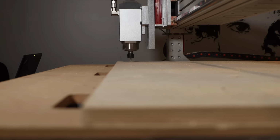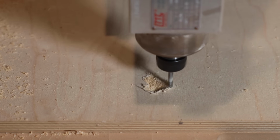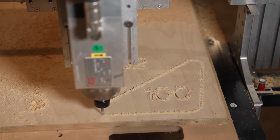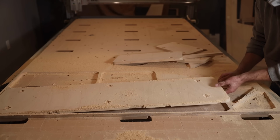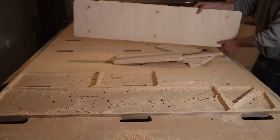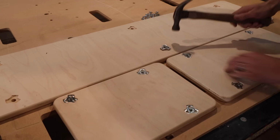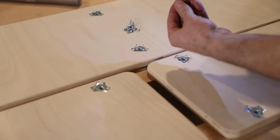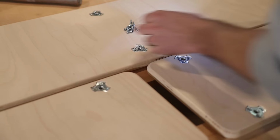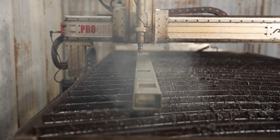While the dumbbells were getting powder coated, I started in on making a flat bench and a seated bench, which is what I found myself using the most at the gym. I recessed slots for T-nuts into the 3/4 inch Baltic birch seat backing and rounded over the edges. I notched 3" by 2" tubing for the benches on the plasma table, and I thought I might as well mark cut lines while I was at it, which was handy.